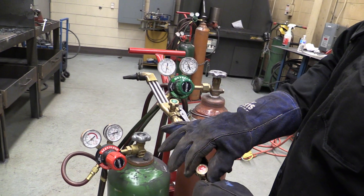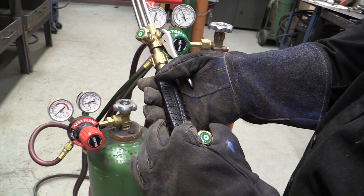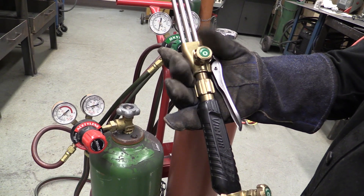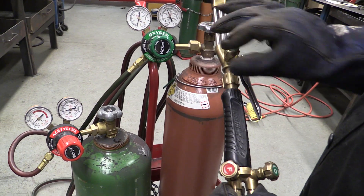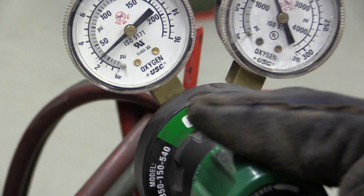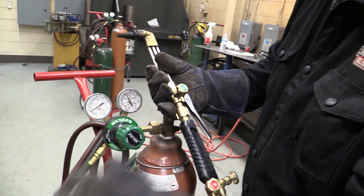Now we're going to move to the oxygen. Our fuel gas is on, and we're going to move to the oxygen. We have two oxygen dials — this one we're going to turn on all the way, just open it up. What that does is allow the oxygen into the mixing chamber to go to this valve, so there's no oxygen coming out of the torch right now. I turn this one on and there's still no oxygen coming out because we haven't set the working pressure yet. So I open up all the valves wide open, just like a garden hose, then come in and bring in the working pressure. The working pressure should be about 40 to 50 psi. Then I shut the valve back off. Now we're charged — our torch is charged and our working pressures are set.